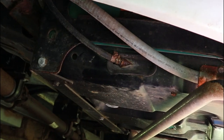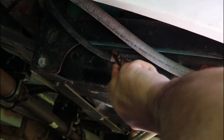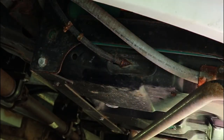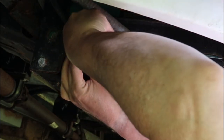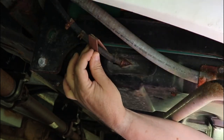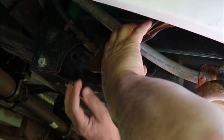What you're looking at here is the side of the generator below it. This is the fuel line coming into it. I'll put this wire loom up here and get it out of the way. It's got a little clamp on it that goes onto the fuel filter — that's the first thing we'll take off. When we pull this fuel line off it's going to leak, so we need to crimp it. I like to just take two little pieces of wood and put a pair of vice grips on it, and that'll stop it from leaking.